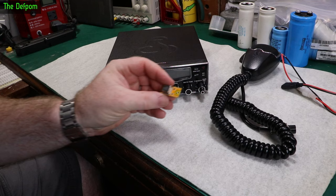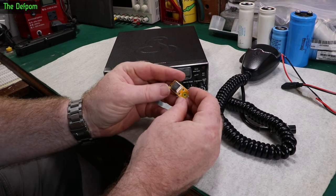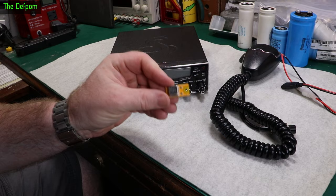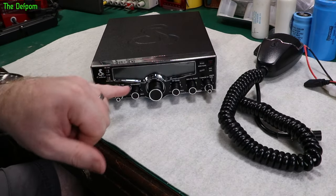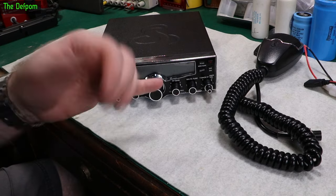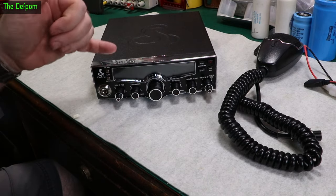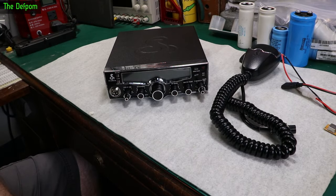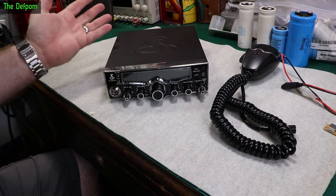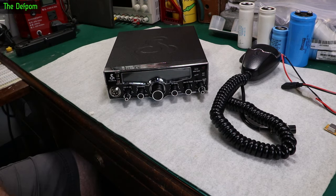What I normally do on these radios is I've got this little modification board I put in, which I designed — a really simple board — and with this board I can put these N channels into these radios. The only problem is with this particular type, they won't display the frequency because the display is driven by a controller, and because I'm not changing the microcontroller side of it, that still displays incorrectly. The radio will be on these N channels, they just won't display it, because it has a frequency display on this particular type.